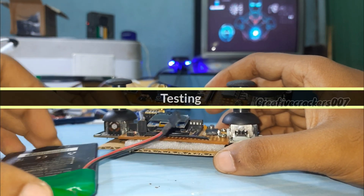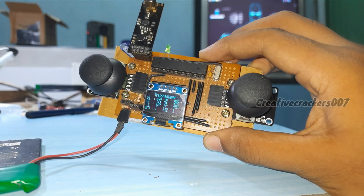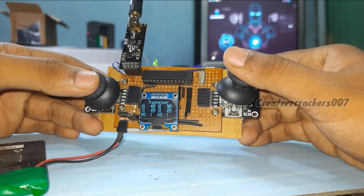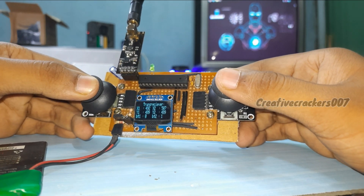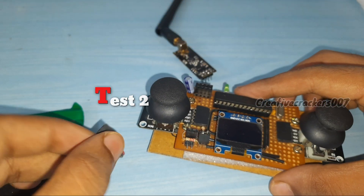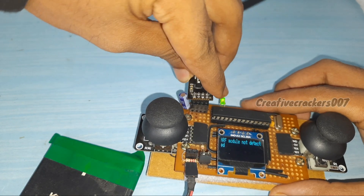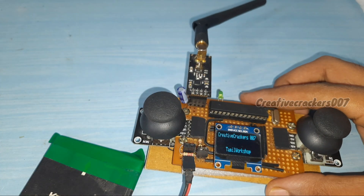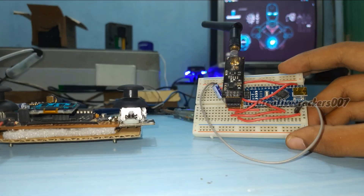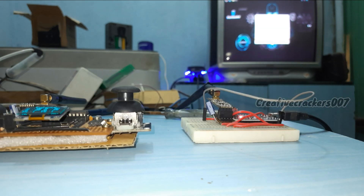It's time to test. By gently inserting the power supply, we can see the logo of our channel and the values of the potentiometers on the OLED display. By adjusting the joystick, we can see the values are changing, which means our transmitter is perfectly working. If the NRF module is not connected properly, it will display 'NRF module not connected, not detected.' Just insert it and restart. Now it's working properly. To verify transmission, we make a simple receiver and open the Arduino IDE with the receiver sketch — the addresses are the same.